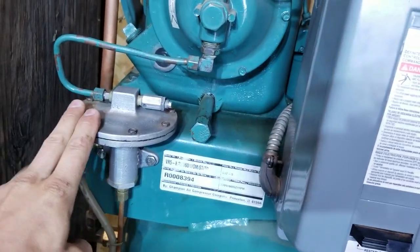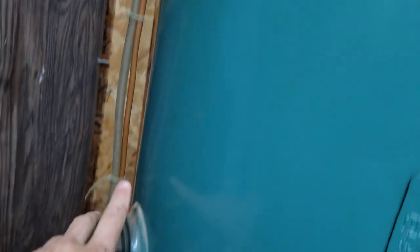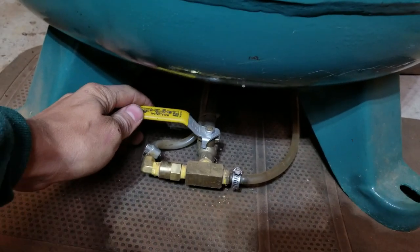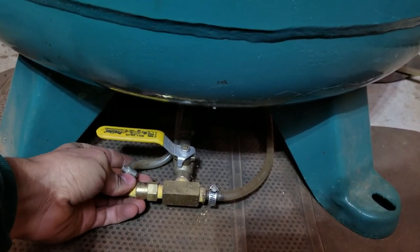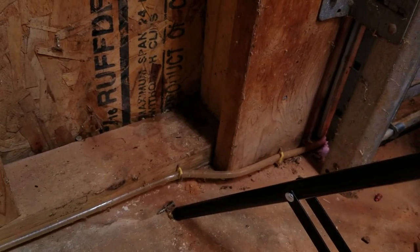I had to run a copper line here. Come down — it'll be a little dark. I have this valve here that vents the air out, and it siphons off stuff here. It just comes here and siphons off and blows out the back of the garage, so it gets the moisture out of the bottom of my tank.